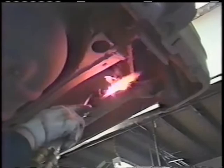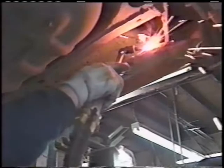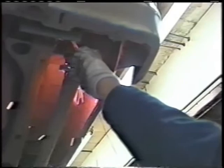So now we're going to go to the back of the car. We're going to cut that strap off on either side. Okay? Again, trying not to use a lot of oxygen. Don't want to burn yourself or others. We've got one more side over here we've got to cut. So we're going to cut that off. Again, not a lot of oxygen in case you run into any dirt or anything. And now you've got that loose, you're ready to take it out of the vehicle.